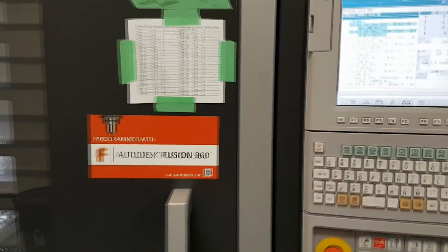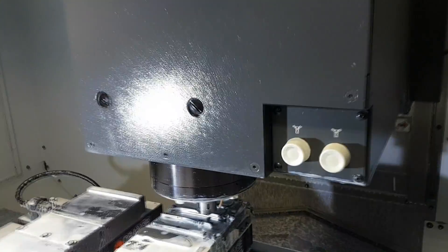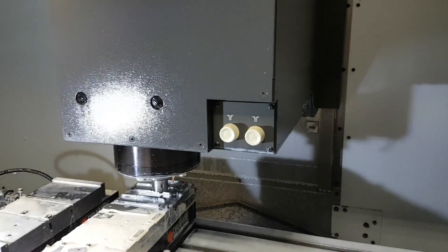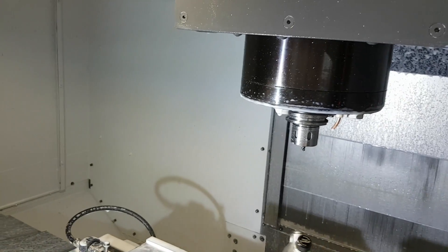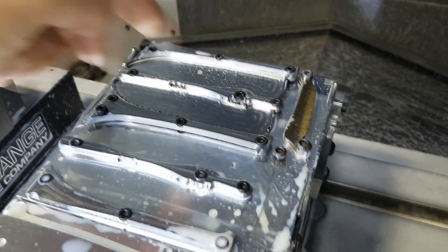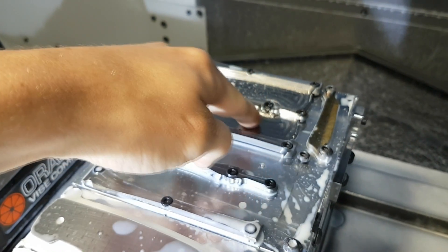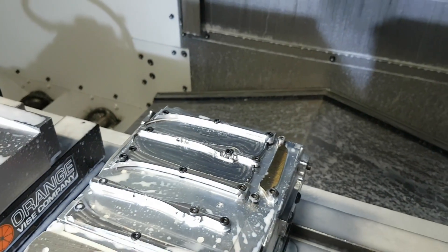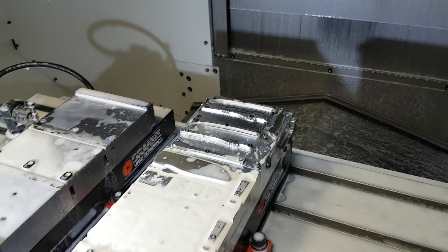Quick little thing — I forgot that I had posted the pattern in Fusion 360, so it's actually trying to make two pairs of handles instead of just one pair, which is a waste of time. So we're going to jog it up and take a look at what we've done. I milled the handles because they're too thick, milling them flatter to basically 125. Looks pretty good finished going so slow. I need to re-post the code and get rid of that pattern so it's not wasting time on a second pair.